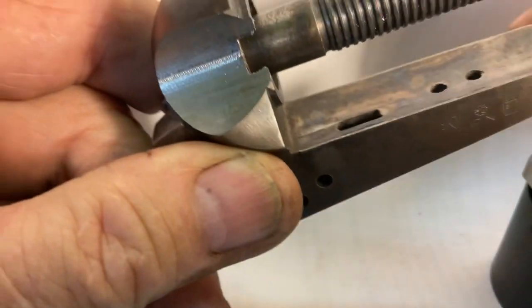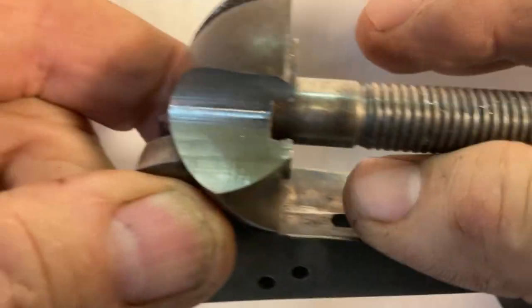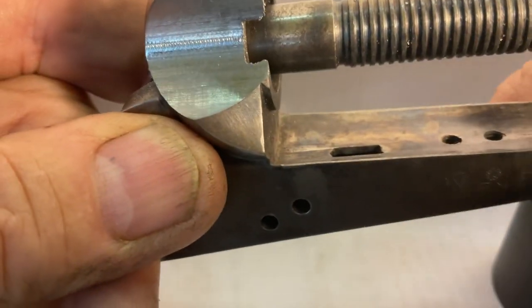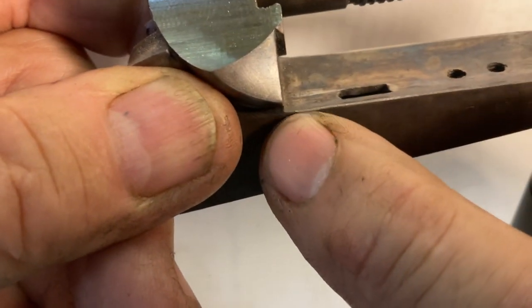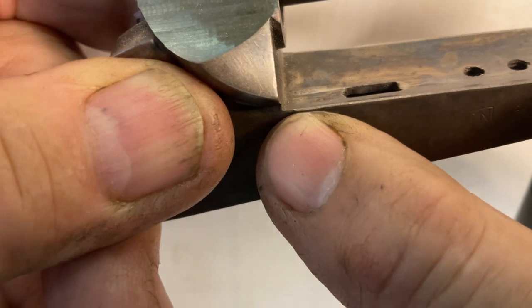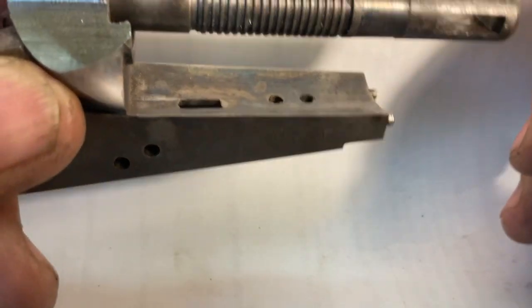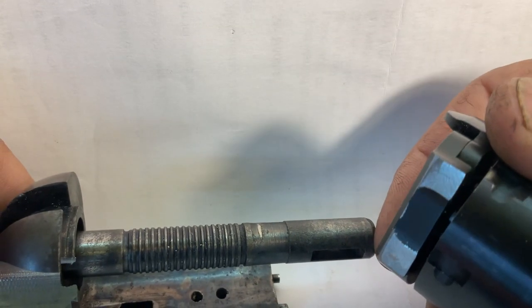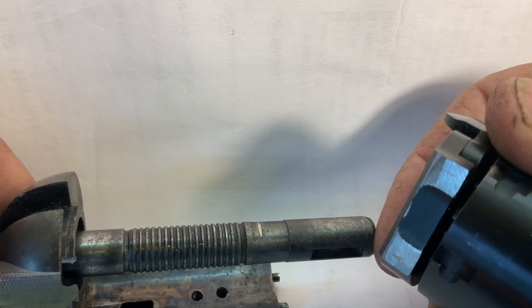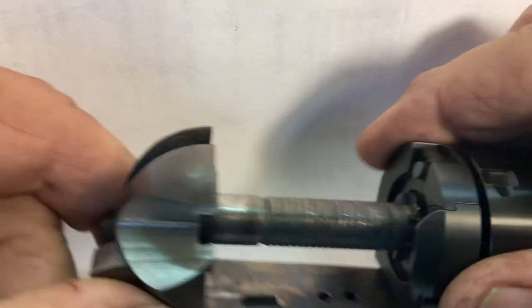If you look here at this frame, after they shell mill this cut — which is curved — they've gone back in a production method and taken the sharp edge off, but they didn't go all the way back. See right there? So that spot right there is problematic. That raises the foot. You can touch that up with a file. It's probably still going to need filing on the foot too. You can tell after you've slid it on a couple of times where it's marking. I've got to go back and clean this up and sand it. This is just a fitting stage.